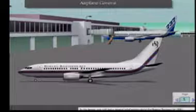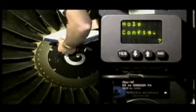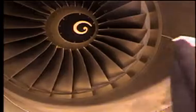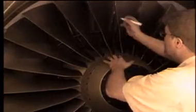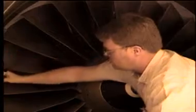First, prepare the aircraft for the onboard fan trim balance procedure per the Boeing Maintenance Manual. Make sure that the balance screws on the rear spinner cone match the balance screw locations in the airborne vibration monitor. Obtain a balance sheet from the Boeing Maintenance Manual. Install the protective flooring in the inlet case. Locate the number one fan blade, which is immediately above the offset hole on the fan blade rear spinner. Use an approved marker to properly mark the number one fan blade.